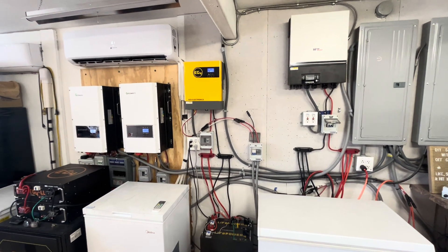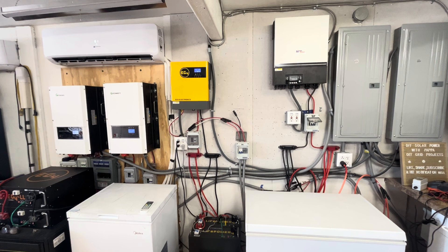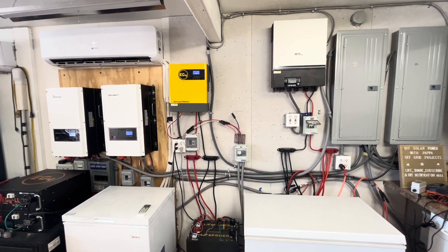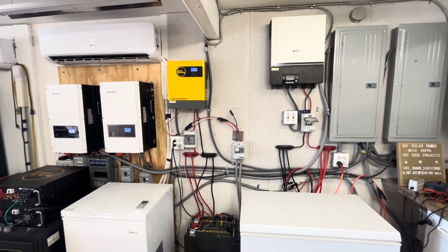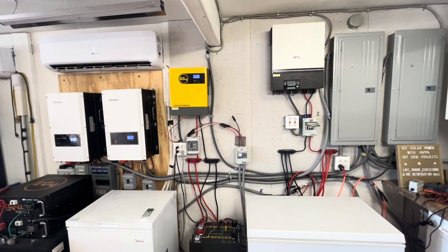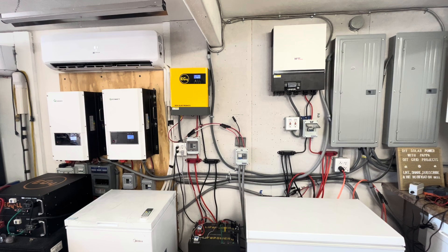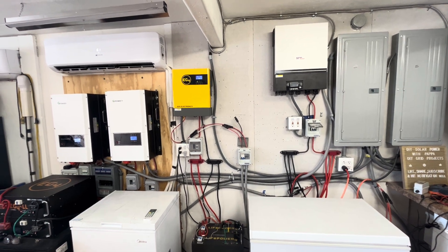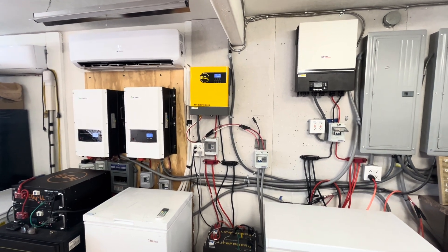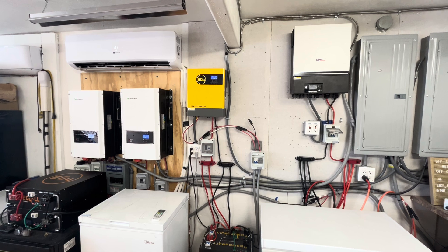We're doing some different things on the arrays in the backyard. We're also putting a slant on all of our pergolas so that water will drain off the solar panels. We had them on flat pergola roofs but found that water was puddling and getting into the solar panels. If we just put a slight angle on them, we can get the water to drain off and not get behind the glass.